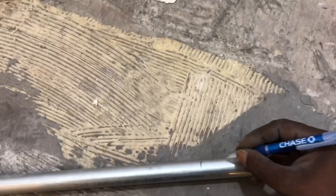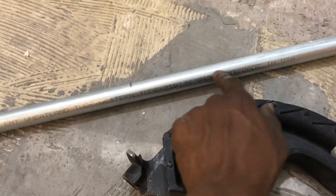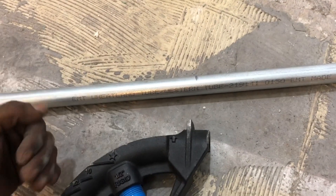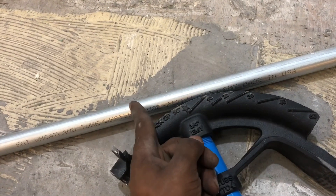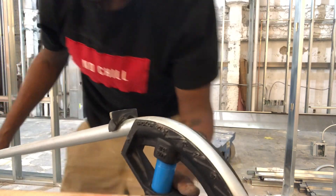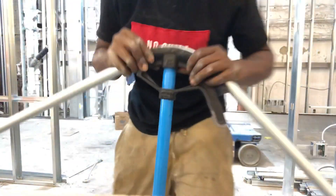44 is up to the right. Now, another quick tip: remember when I said this part is the 6-inch mark in the bender? If I bend it turning this way, it will give my 44 mark already. But if I bend it turning this way, it will bring it 6 inches back — the lift-up will be 6 inches back. So if I turn it this way, lift-up will be right here. This is our last bend. We do that 90, put it at 44. When you do a first bend next to it — like a 90 — you put the next bend at the star. Leave it at the 44 and put it right at this star right here. Finish our bend.